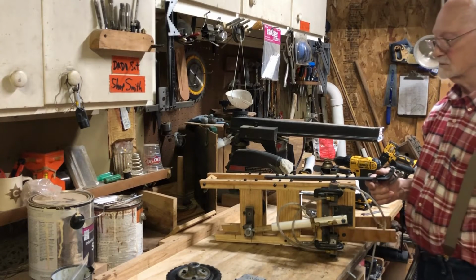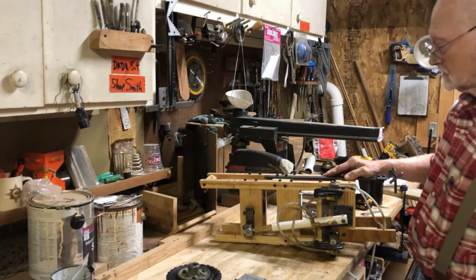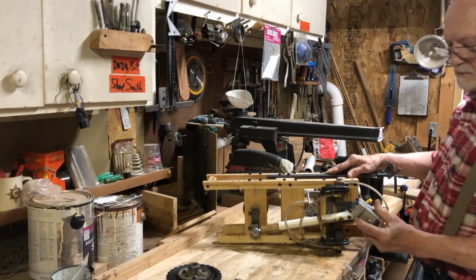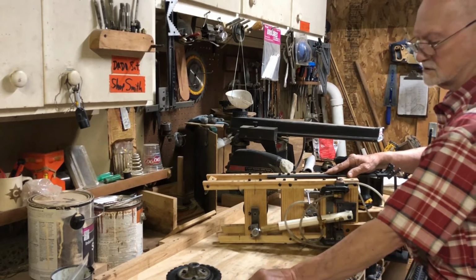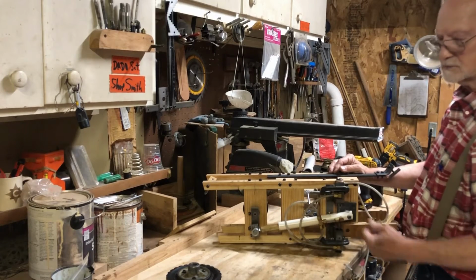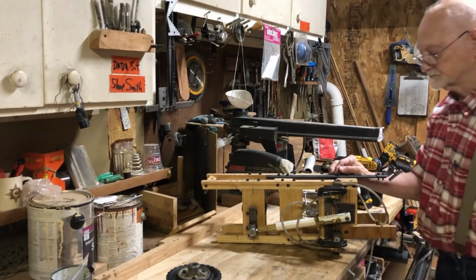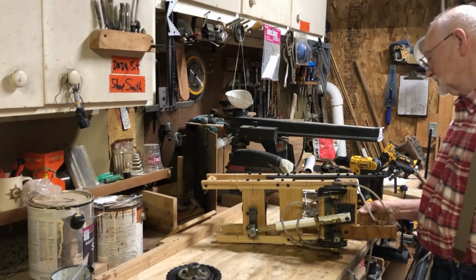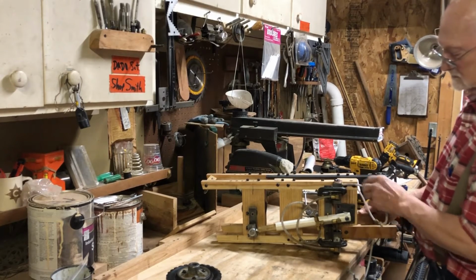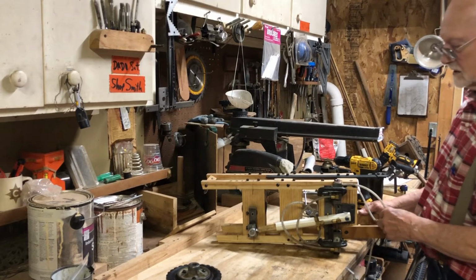Yesterday afternoon, I decided I was going to make some changes on this and then put it on my bicycle. I wanted to change the valves, which was these that had a diaphragm in it, but when I tried to use it, it was really too hard for the thing to push those, because like I said, the diaphragm caused too much pressure to be needed. So I changed out these valves, but it took me a lot longer than I was expecting. They were made for a different designed air motor, so I had to make some changes on how I faced it and which way these connectors were turned in order to make it work.